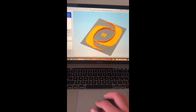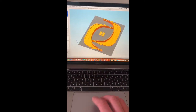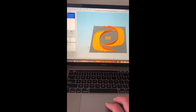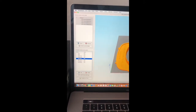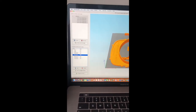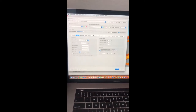As you can see, I've arranged my models on the build plate so that I can fit two at once. Wherever possible, efficiency in the way that you arrange your models is definitely helpful. You can't just send a 3D model directly to a 3D printer, so you'll apply a process. I have my material settings for the material that I'm using here. All of those settings specify information such as the thickness of the layers, the speed at which the extruder is moving, the temperature at which it's printing, and a whole bunch of other variables.